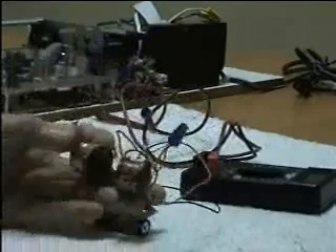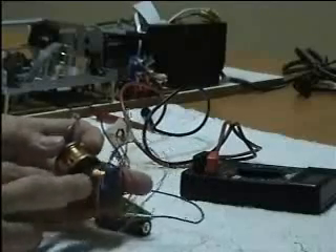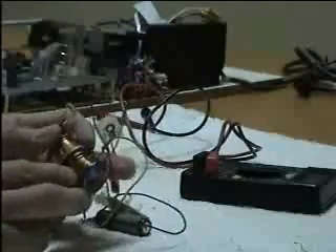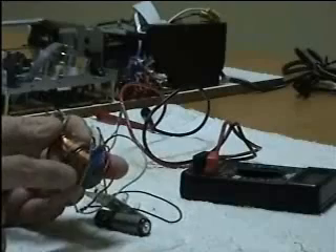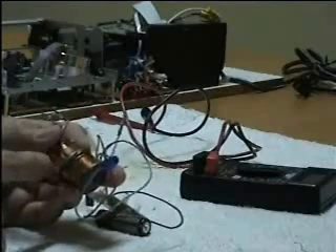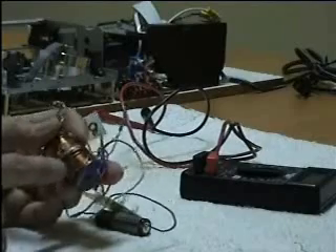The coils I use are coils that can be found in speaker boxes or in any kind of amplifier circuits. They come in various sizes, but these are pretty good ones. The important thing to remember is to get two identical coils, because this works on the flyback transformer principle. The back EMF must be able to induce the voltage for this experiment to work, which is why they must be identical.